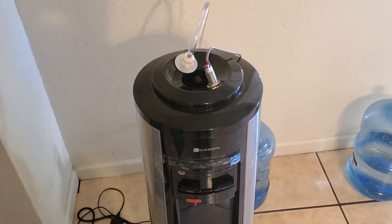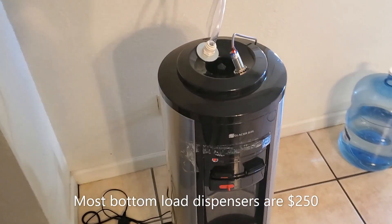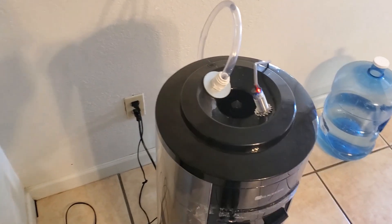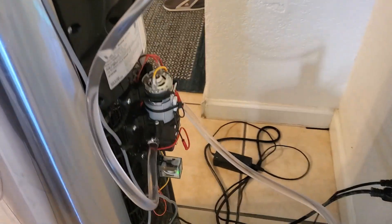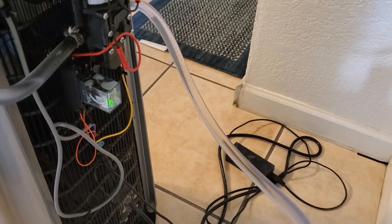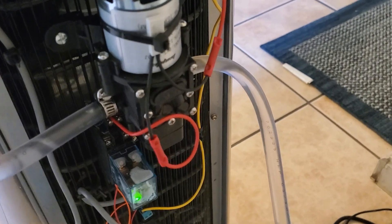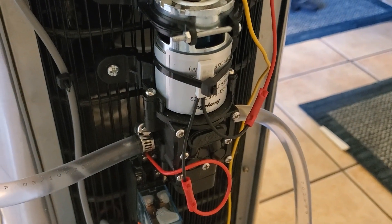So for this project, you'll need about $20 worth of parts. I recommend getting everything off of eBay because it's cheaper. You'll need a NPN capacitive sensor, a push fitting, some tubing, a 12-volt diaphragm pump, a DPDT relay, and I've also added a temperature sensor for a fill-safe, which will shut everything down at 104 degrees.